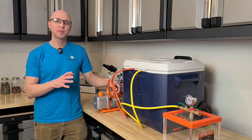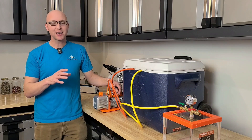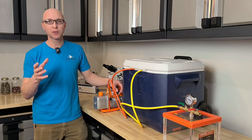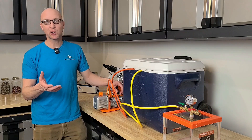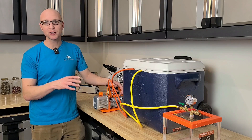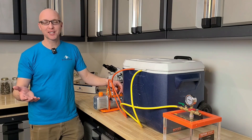After a lot of trial and error, this setup doesn't quite work for fruit, but I do think it would work for something like meat or candy. All said and done, this setup cost me $287, but it needs a little more modification before it'll work for things like fruit. My next step would be to enlarge the holes on the cold trap so they don't ice over and plug. The other option would be to use a little bit less dry ice so it doesn't get as cold, though you'd have to feed it more often to regulate that temperature. Don't forget to subscribe if you haven't already. Thanks for watching.